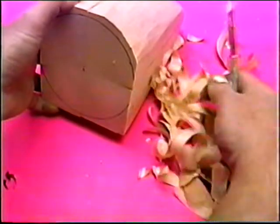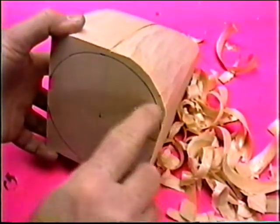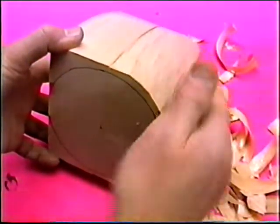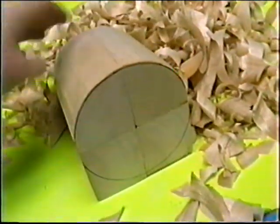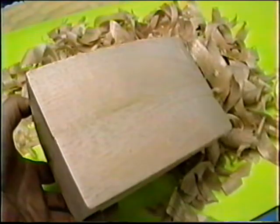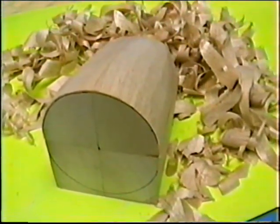Anyway, that's pretty much what's going to be going on here for the next giant amount of hours. Just going to work one corner at a time, leaving it plenty oversized, and then we have to put that notch in for the ring, slide this right up on the former, and trace the actual line. I just would like to get as much roughed off as I can before I actually have to cut those notches for the ring. Little by little, we got half of it roughed out in this little time, but now what we have to do is start working on the contour, so that we have the same contour. But getting all that material off, even if we just get that done tonight, that'll be one big step for mankind, one big metal chip from wood chip for mankind.